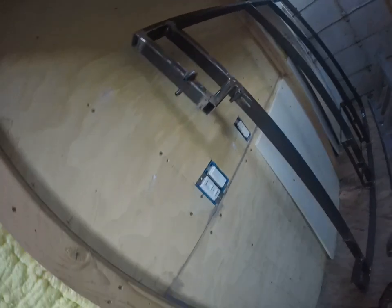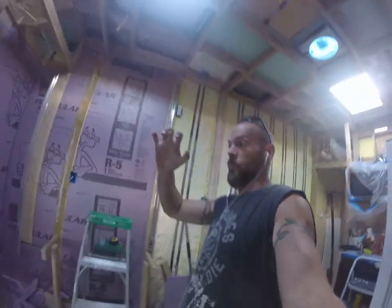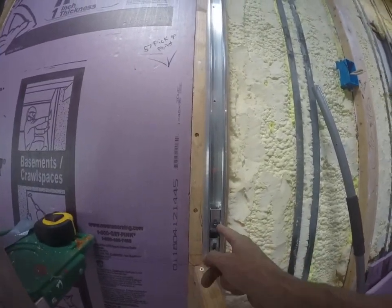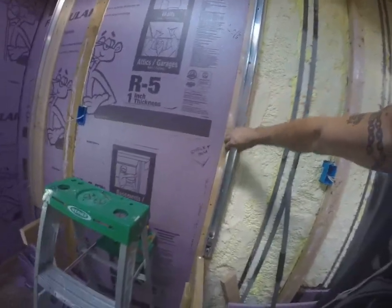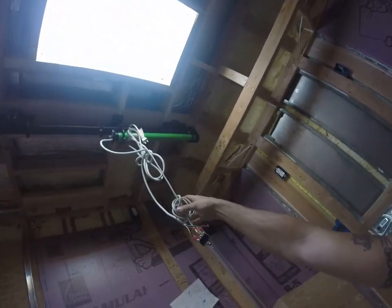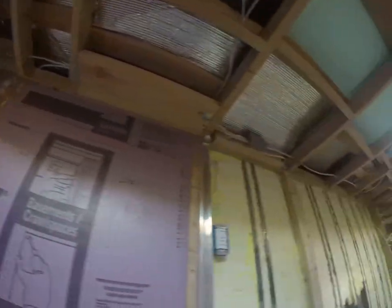Assuming the television isn't too big, wheels pop in here and they're on springs so that as the two walls pull, the springs will allow the bed not to snap or break. That was also a custom piece. These spring-loaded wheels ride in a hanging door track that's being utilized for the bed track. There's a motor here. We cut this down — the original one came longer. These are the pulleys in these four spots.